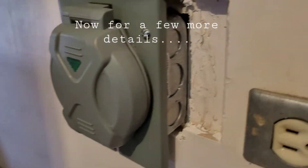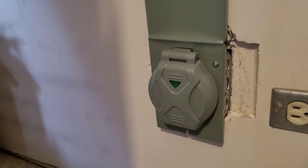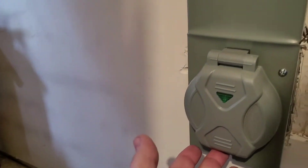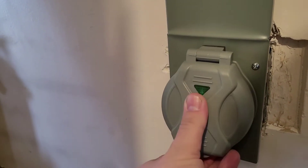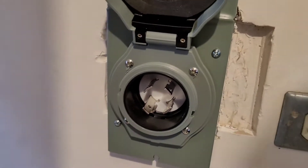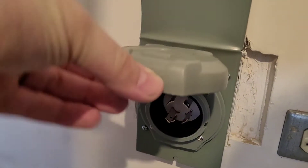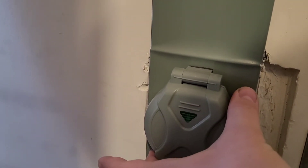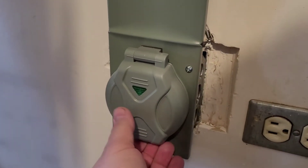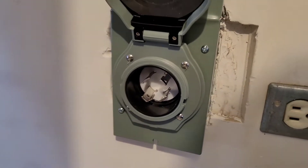Right here I actually had an electrical outlet — a welder outlet — and it has wiring provisions for 50 amps. I don't have a welder, so what I ended up doing is I put an extension box on here and used a box that I had, which has a recessed four-prong 240V 30-amp setup. I retrofitted it to go over this steel-plated box extender so I could use this as a generator port. This is how I hook up and back-feed my house — through this port right here.